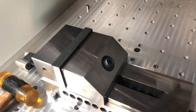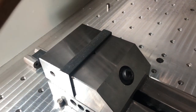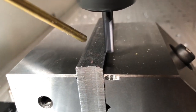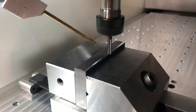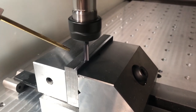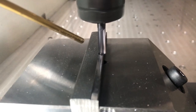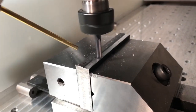On to the upper plate. The material is A36, just common mild steel, hot rolled — so you can see it has scale on it. It is important that your first cut removes that scale completely. Don't scarf over the top of it or something like that; that will ruin an end mill in a hurry. It is important that you remove it right with the first pass.